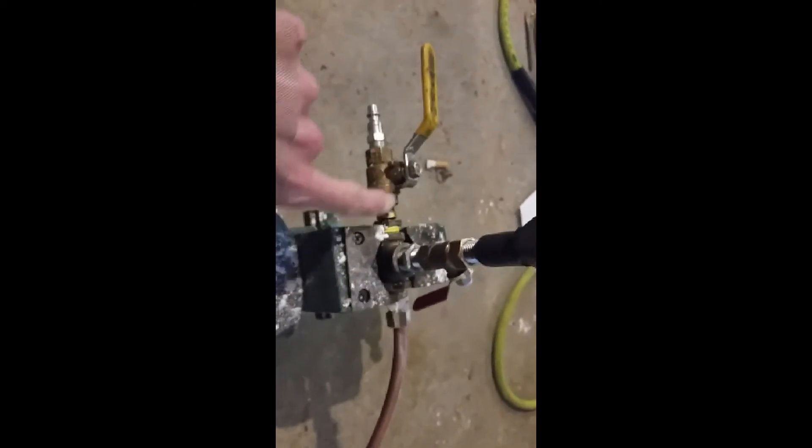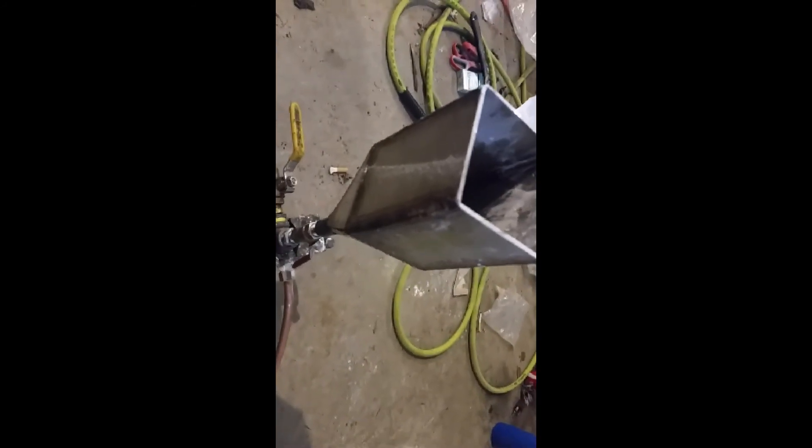There's still a little bit of flour or powdered sugar in there. I've got videos of the powdered sugar and baby powder — the flour didn't work so well, mainly a feeding issue. It doesn't like to feed all the way through my narrow hopper. That mix runs at a lot lower pressure coming through the ball valve, and then out through this copper line, which is what would be in the pulse jet. Right now I'm just testing it in open air to see what works. I'll show those videos next, and then we'll see how well charcoal dust does — I ground that up to see if I got it fine enough to actually combust.